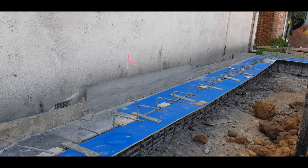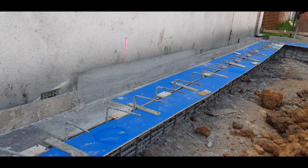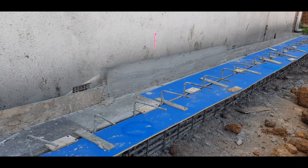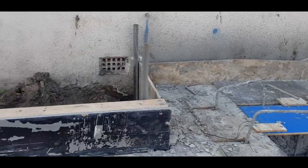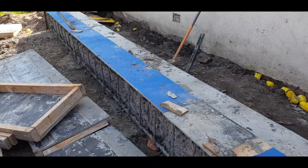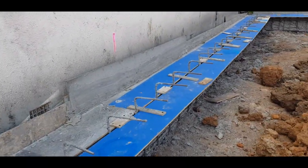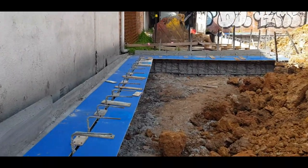We are at our Moon Ponds job. The last time we were here we were showing you the digging of the bored piers for the cap beam to the basement. Last week we actually poured the cap beam, which you can see here — that's a strip of concrete that runs across the top of the piles and ties them all together to create one long, continuous piece of concrete to stop any of them rotating forward.